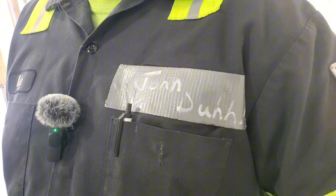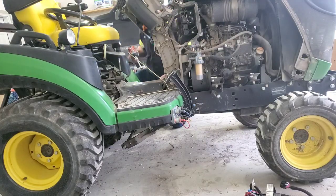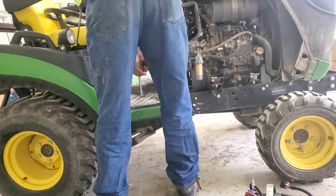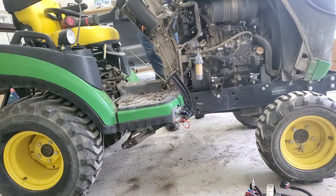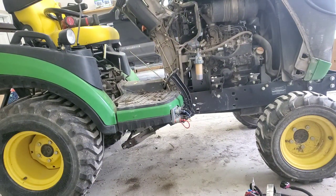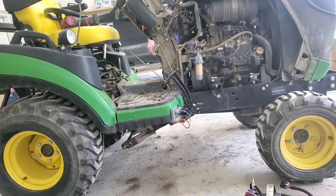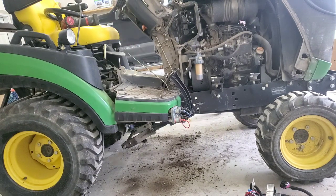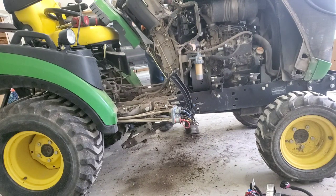Today I'm working on the John Deere. As you can tell, I already kind of started on the project — I got the side panels removed and the dash loosened up, and pulled off some of the panels. From here, I need to take off the floor pan. A couple of bolts down there bolt the floor mat and the pan all together — it's like 10 bolts or something like that. That's where the loom crosses from the back half of the tractor to the front half, so that will have to come off.